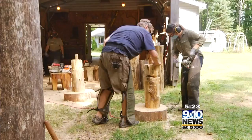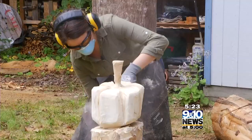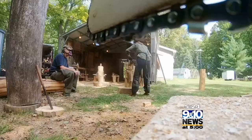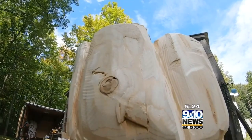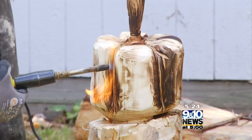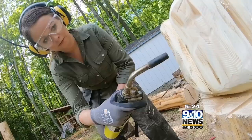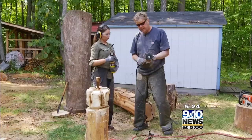Now it's time for the finishing touches. Once we get our carving work done, we're going to want to move on to the sander. The sander is going to get rid of any blemishes we might have. Making sure to clean off all the sawdust. Add a little fire to the mix — burn all of the fuzz. You can actually burn it quite heavily so it starts to turn a little dark. One last buffing step with these sanding flaps.